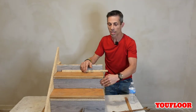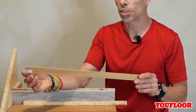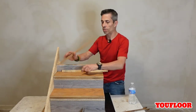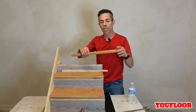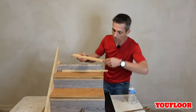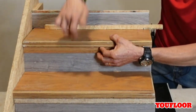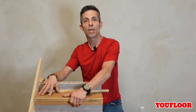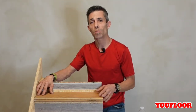A faster way of fixing this is to get a piece of very thin trim. This is a scribe mold used for cabinets, but they sell all kinds of trim at Home Depot — you can get it primed or regular wood color. The treads that were there are black, so if you have the stain that was used, you can get some natural wood and stain it the same color. Then take the trim piece, slide it up underneath there, nail it, and you'll have matching right here. That is really going to be the only way to fix this problem unless you take the whole staircase apart.